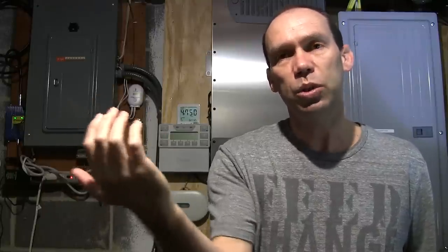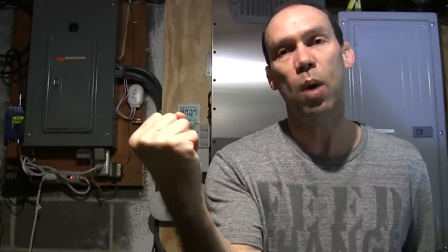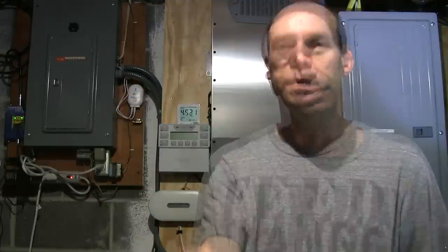Another good point: if you're working in an industrial situation and want to touch an electrical motor to check whether it's operating or to feel its temperature, the best thing is not to hold your hand out flat to touch it. Use the back of your hand. The reason is that if there's a short and it's live, touching with the back means your hand will naturally clamp away from the motor rather than grip it. You'd rather have your hand clam away than grab onto the motor, which could electrocute you. So always consider touching things with the back of your hand.